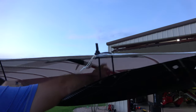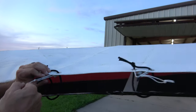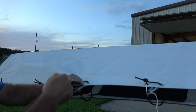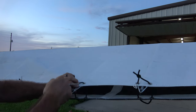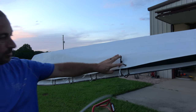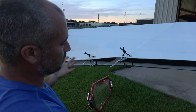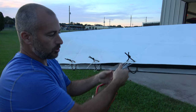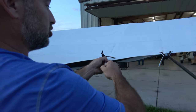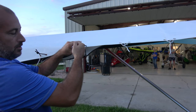From here we bring our sprog in, and now we can remove upper surface battens. People often ask whether it's harder to put the batten in than to take it out. Here it is in forward motion — you put this on, put this on, put your thumb through here, put this over, and now that's in. It is a little quicker coming out, but not much difference in build time versus takedown time — not more than a minute or two.